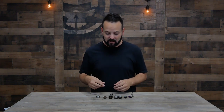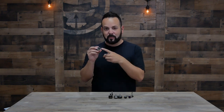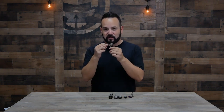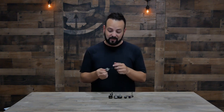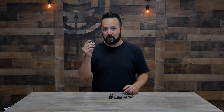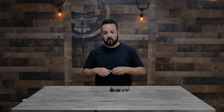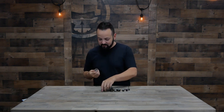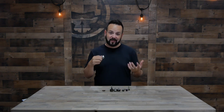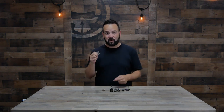Another specification that affects cost and performance is the air gap — how close the magnets in the bell sit next to the stator. In theory, the closer that gap, the more power the motor can put out, but achieving a tight gap requires finer machining. Higher-end motors tend to have a smaller air gap. There are also different types of magnets used in the bell: some make more power, some are more expensive to source, some are cheaper.